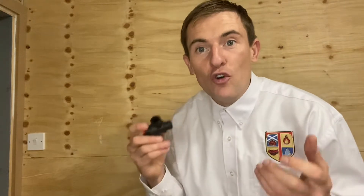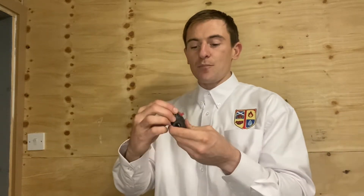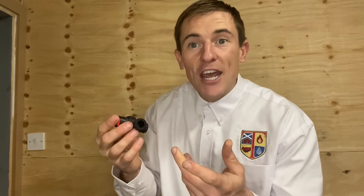So things that go wrong: you might need to replace it or recharge it. We always try to recharge it first, and if it doesn't recharge, you replace it. Quite often these will get weak and allow water to escape, which reduces your pressure. That's usually the typical scenario where your heating pressure is dropping — it's normally caused by these, unless you've got another leak on the system, or dirt has got in when it was opened and it's allowing water to come out. You can check that by checking the pipe outside. Usually if it's a vessel issue the pressure won't come right down to zero — it'll sit up a bit from zero.